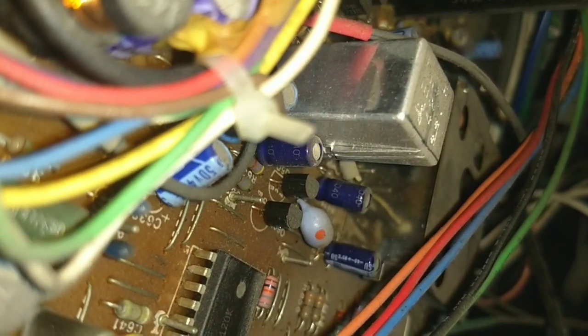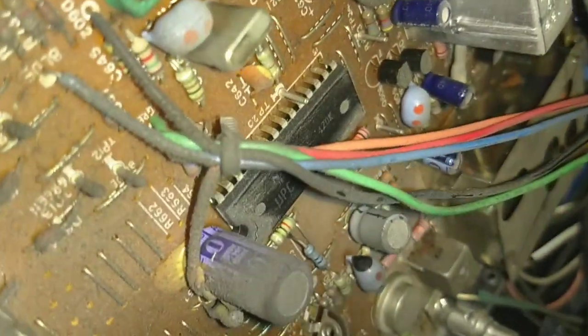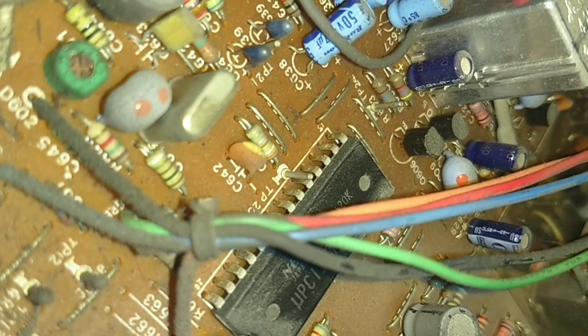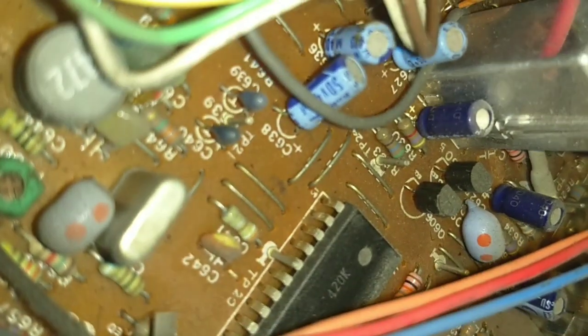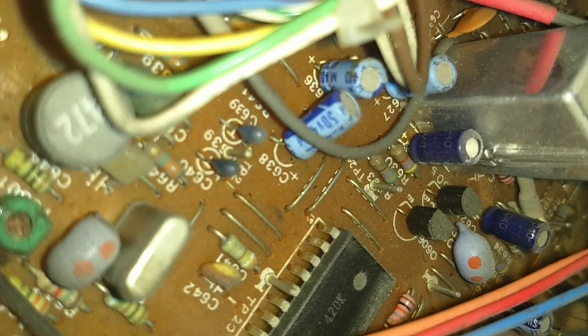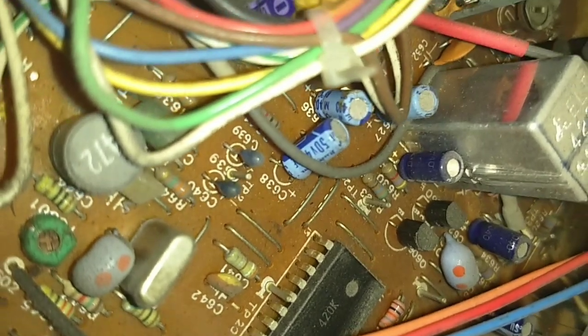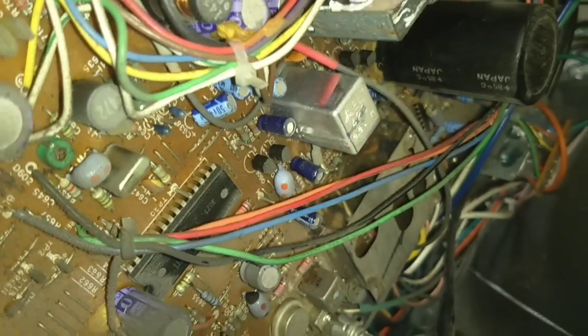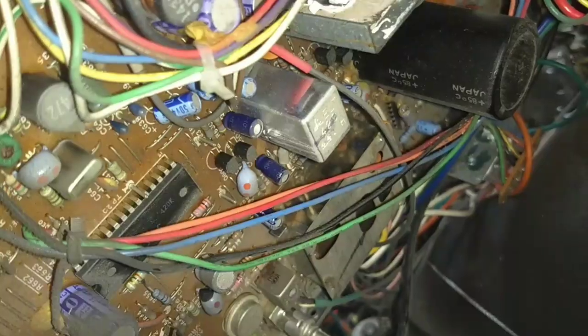I still have to check the one hiding in here between that wire mess. There's a patch of caps here — 4.7 and the like. And those tantalums could be bad too — that's also part of the circuit: C460, C639, and C640. We've got to check those; tantalums are known to go bad at this generation. I'm going to need two hands for this, and if nothing else we'll start to clean up the board. But nominally, that's what we're looking at so far.